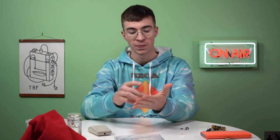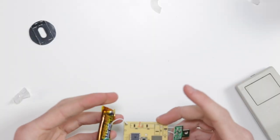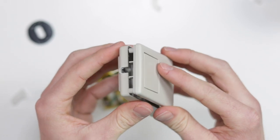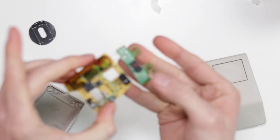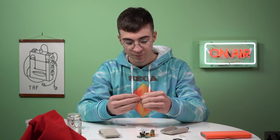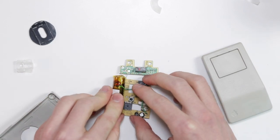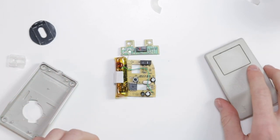It's not an accurate grey but it will look better than it just being a big black circle on the bottom. What we need to do is find a way to mount everything. Unfortunately the little battery cage that I made won't fit, so I have just had to Kapton tape a battery in here. But there's absolutely nothing stopping me from having a rechargeable battery in here — I could maybe try to recharge it using a little 3.5mm headphone jack, which would make it really nice and neat. This little PCB that has the main left click on it isn't going to need to be adhered at all, but the battery is. So I'm going to stick one of these little foam pads down on that battery and that should adhere to the inside of the housing.